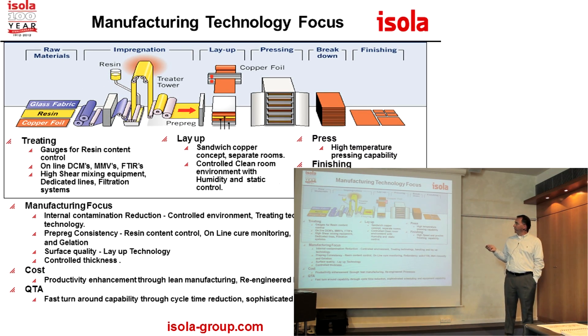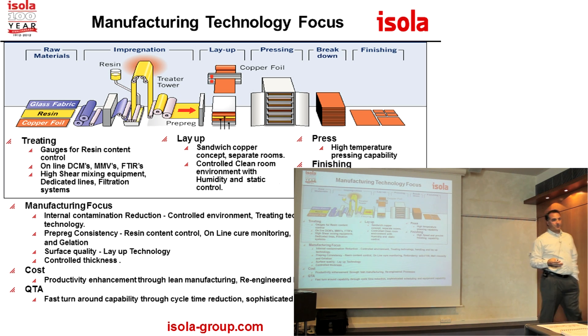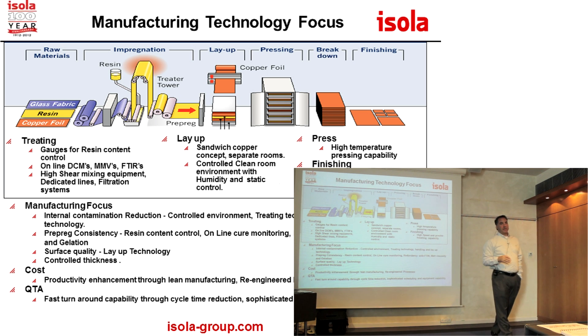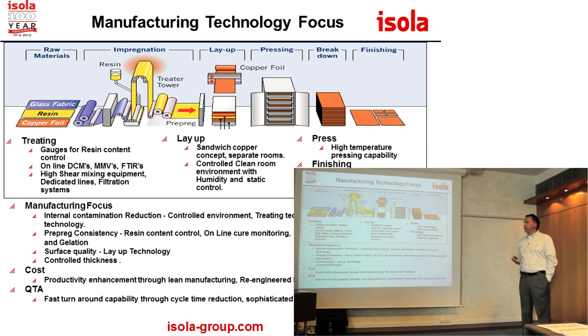Regarding the copper foil, the copper foil, the stainless steel plates, and the prepreg are all kept in separate clean rooms. You have to be in a full bunny suit — you can't just walk in and out. If you get anything on the copper surface when it's pressed and that's trying to be made into an interlayer, you'll have an open or a short if something is interrupting the copper on the surface of the material. Having a very clean surface is critical — no pits and dents, no fibers inside or underneath the copper. Everything is done in a clean room environment and shuttled from room to room so everything is kept separate.